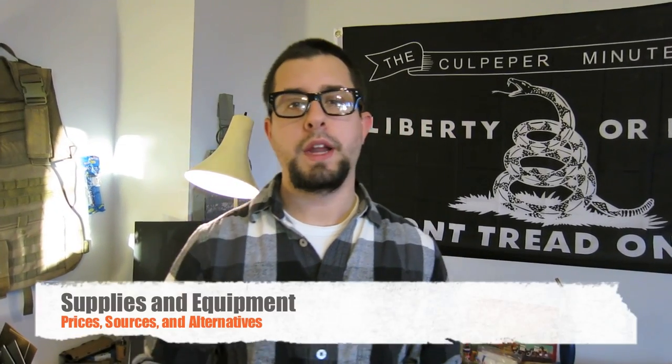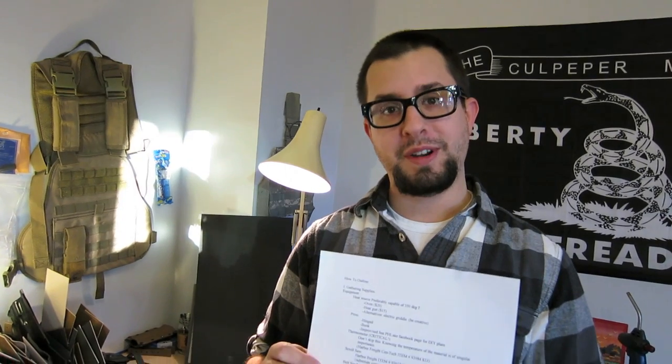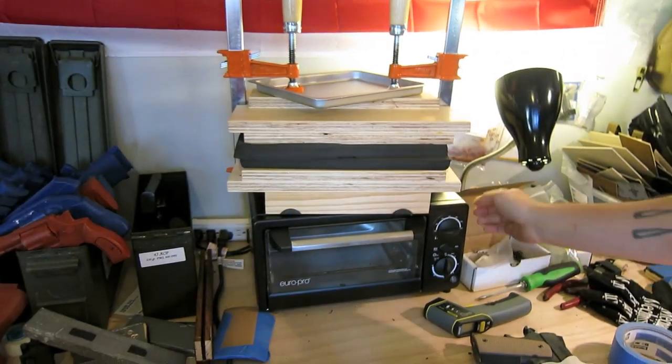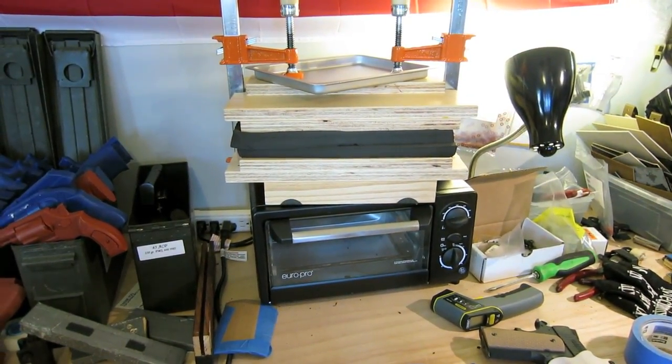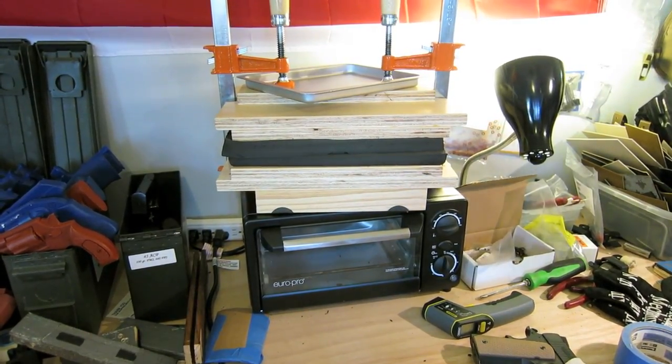So with that being said, let's get started on the materials and price list and availability. Before we get started, we're going to go over a wide variety, if not a totally comprehensive list, of supplies and whatnot that you may need to get started working with Kydex. Since it's a lot of information, I'm going to do a little reading off of this sheet. I've gone through and sourced and written down everything that I use so I can share with you. First things first, you're going to need a heat source. You can use a toaster oven or a heat gun — those are the two most popular things. I just picked this guy up for $20 at Lowe's.